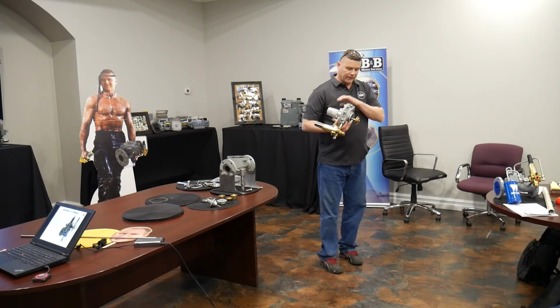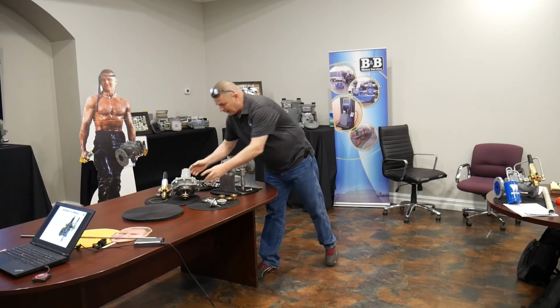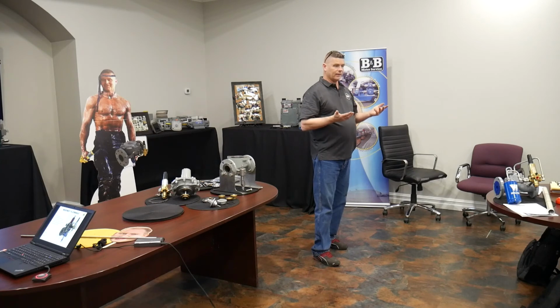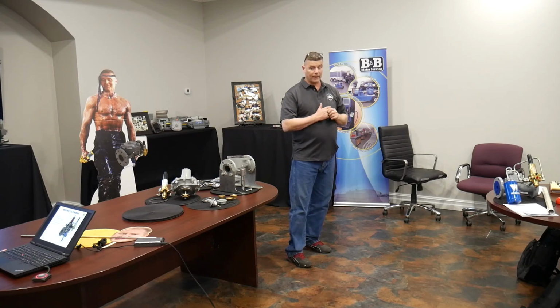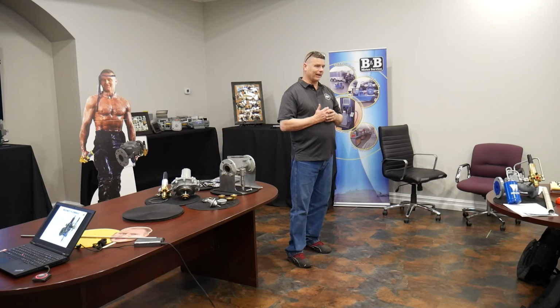So the question is, if I've got problems with dirty gas, do I have to worry about getting into this chamber and cleaning that out? I've never seen a situation where just a little bit of rust or whatever above that piston and the seals has actually affected the seal itself. It has a skirt, so I don't think it's a problem, but when they go to rebuild it, they may find that there's a little trash up there. If it was bad enough to actually block that chamber, though, that would be a problem. That would cause the valve to not want to close fully, because that's your help to get it closed. So another reason to always use filtering with regulators, not let them be your strainers.